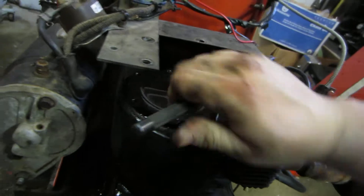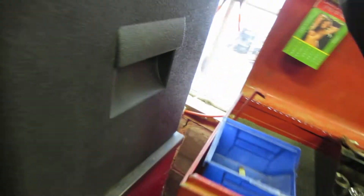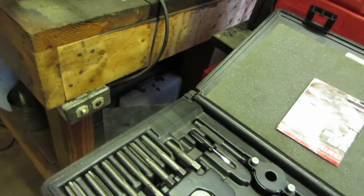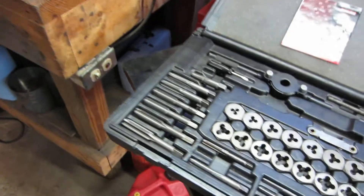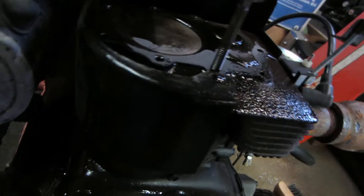So I'm going to switch to another way of doing this. There are a couple of different ways you can avoid obstructions without taking things apart. In this case, you could just switch to a tap wrench, which is a good way to do it. But I also have a ratcheting tap set — it's meant for finer stuff, but it works really nicely on these items here.